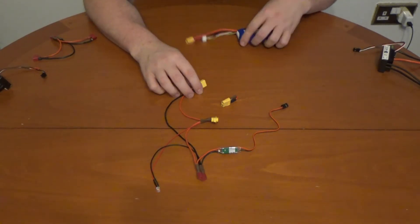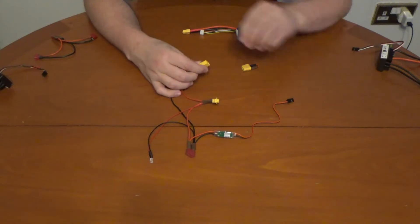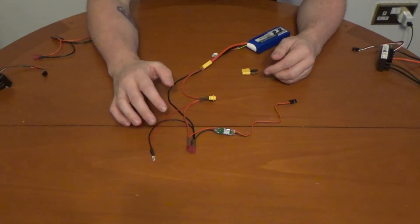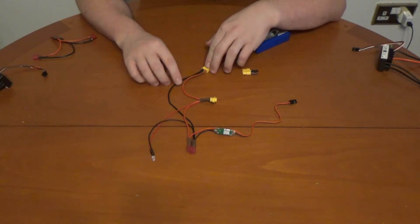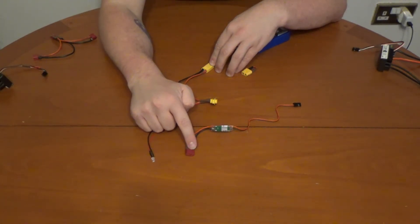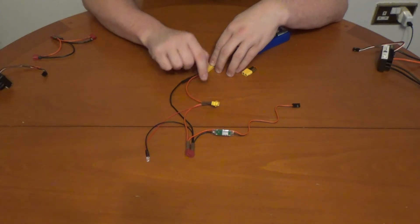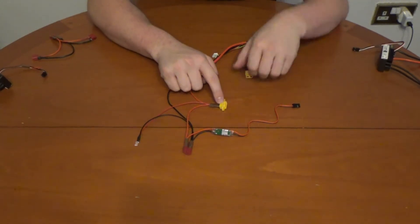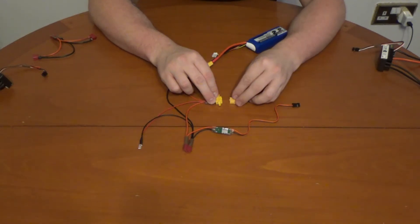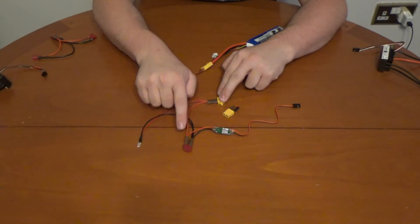As you'll see here, we have this strange-looking wire. Starting off, these two plugs fit in like so, and now the power will be coming through this whole circuit. The black wire goes straight from this plug all the way down to this Dean plug here. The red wire goes all the way to this end, and this is where your safety link comes in. It goes from the positive wire that you connect in here, and that connects the red wire all the way through the loop to this wire, and then to this side of the Dean plug.